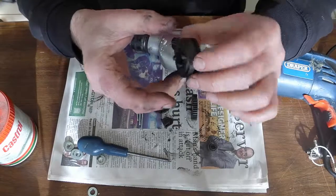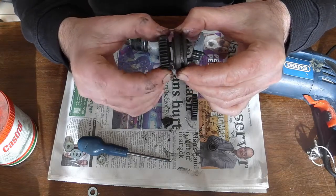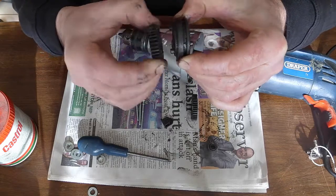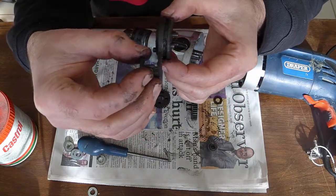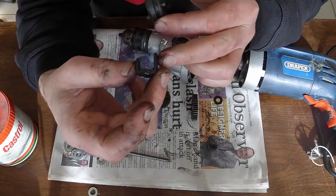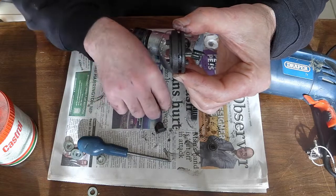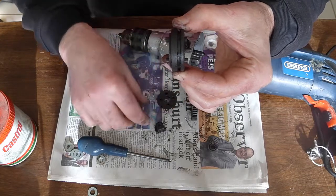Very neat, very simple design. But this one is spinning - it's not engaging. If you turn it by hand it's fine, but as soon as you put any force on it, it pops out and spins. My first thought was that these are now a little bit worn - it's done it quite a few times. It looks like a bit of a flaw in the design, because there's quite a bit of meat on there to actually engage, and for some reason it's not going all the way up and getting a good engagement.